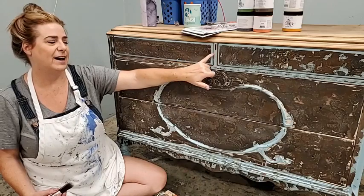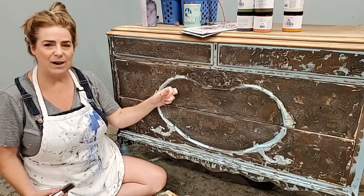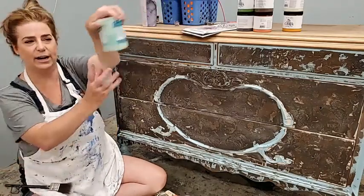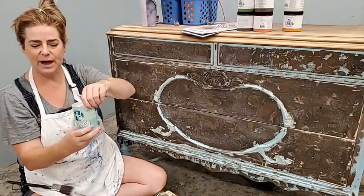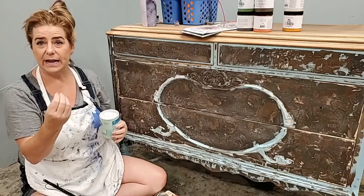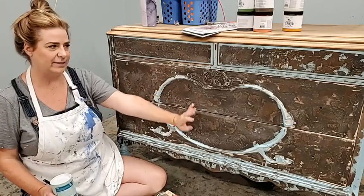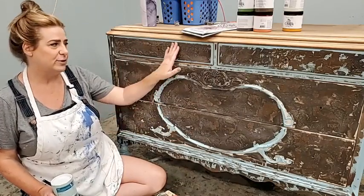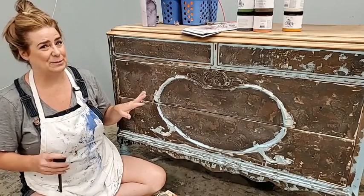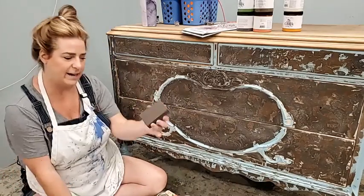It was covered in latex paint, which is what you see here. Last week I showed you the prep: we stripped the top back to bare wood, sanded any loose paint, cleaned it really well, and then we added this texture on the body. I mixed a little bit of salt wash, which is a texture additive — a fine powder you can add into your paint to thicken it. We scraped it on using a bowl scraper, creating this really interesting texture. It's actually a coat of paint.